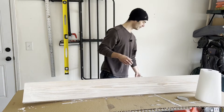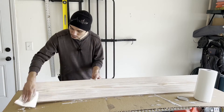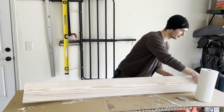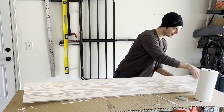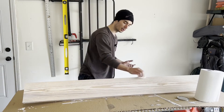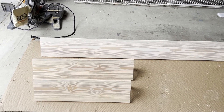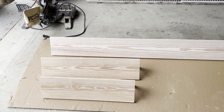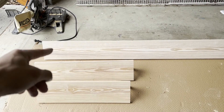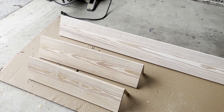So there's the trick — who'd have thought? Read the instructions and mix well. I thought I mixed well, I just must not have. This is what I was expecting; I wasn't expecting it to look almost unstained. I'm also not wiping the stain off super hard — I'm just wiping off the excess like the can says. Again, here's a view of the three samples. All three have one coat on them; the only difference was I mixed the stain a lot better before I did the third board. And so you can see it is a little bit whiter than the first two.